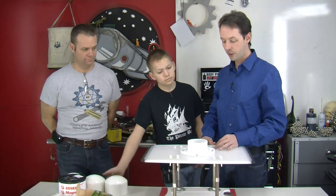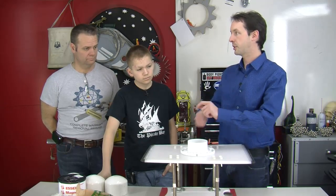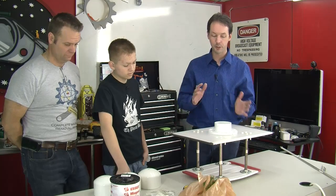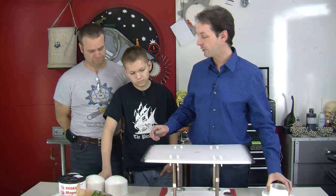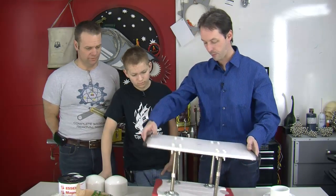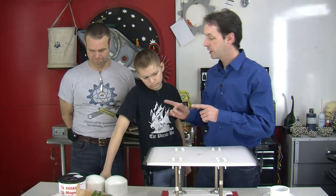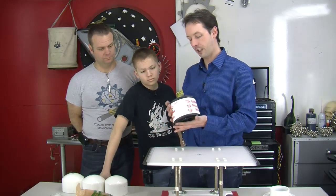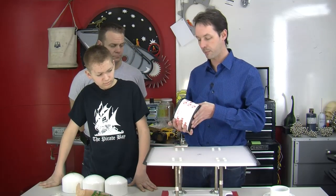I'm trying to do this really on the cheap, really simple. We could do this a lot cheaper — we could wind this on a toilet paper tube and use a nine-volt battery and interrupter — but we're trying to make a real Tesla coil, so it's that balance. You've got a thing of magnet wire. We have a ten or eleven pound spool, 22-gauge high-temp magnet wire.